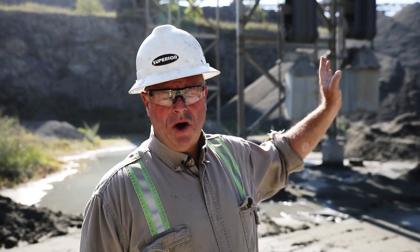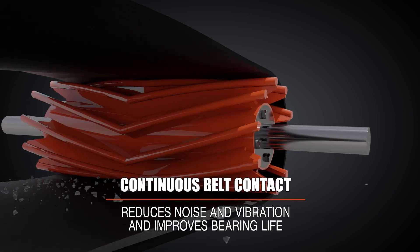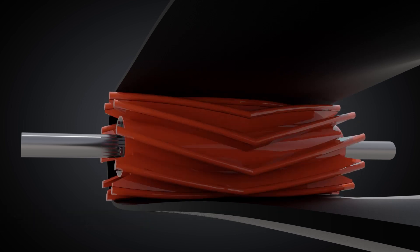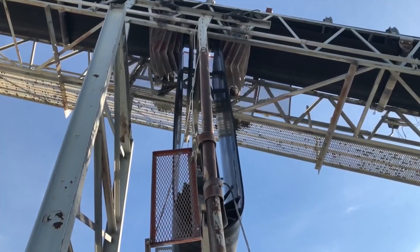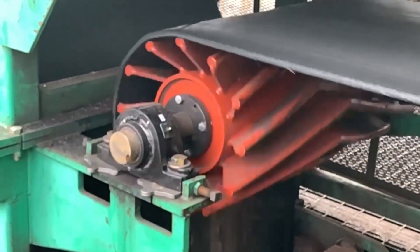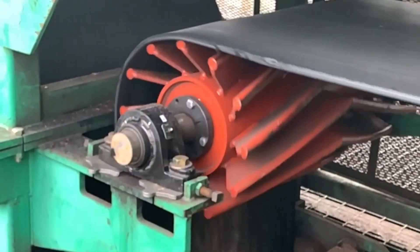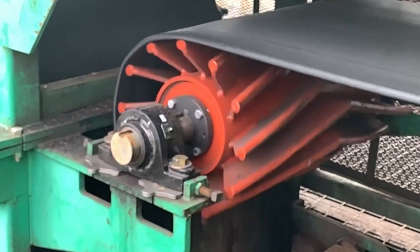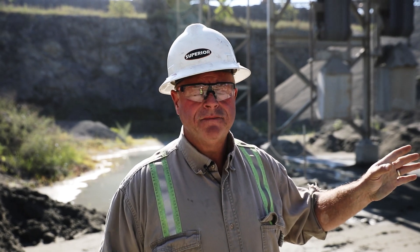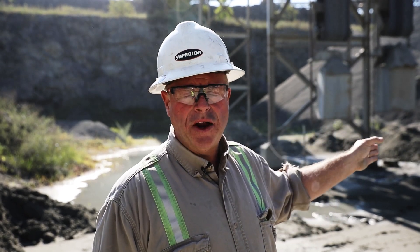Also with sticky material on your bend pulleys, don't be afraid to go with a chevron wing on the bends. Having less contact with the belt will cause less material to stick to the pulleys — a series of bars means less contact, less material sticking and causing buildup. The chevron wing also prevents vibration down through the counterweight and gives you better, longer life. Pretty much in every application, if you see a wing pulley, a chevron wing is going to be a better choice because it eliminates vibration — not just in the counterweight, but also at load points and pretty much anywhere on the conveyor.